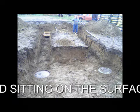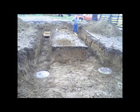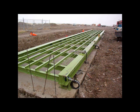In this picture you can see trenches dug between the piling sections. Simply place rebar in these trenches and use the dirt walls as your forms. This ties the sections together and keeps them from shifting over time. In some states a solid pad is required under the entire scale. In that case, trenches are not required as the pad will hold everything together.